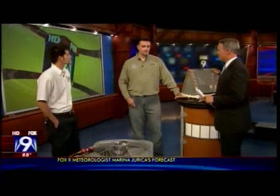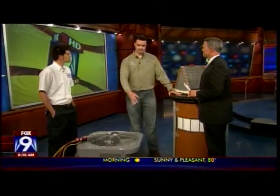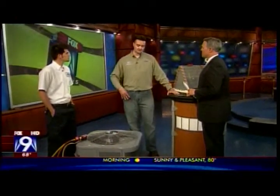As you increase the efficiency of the total system's operation, you reduce your energy bills. One thing that's recommended is a programmable thermostat — you can save 10% to 30% on your monthly energy bills by replacing your old thermostat. You just stop monkeying with it and you eliminate that inconsistency. Any final tips for homeowners? The biggest thing is make sure you're replacing your furnace filter every six to eight weeks and taking the garden hose to the outside of the condensing unit. That'll help increase the efficiency.